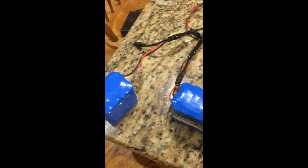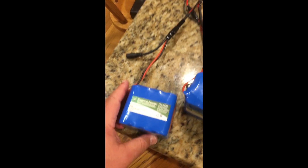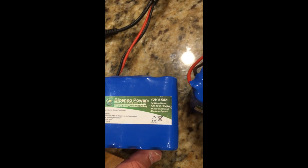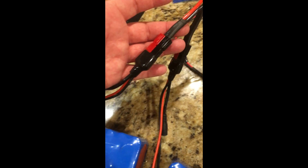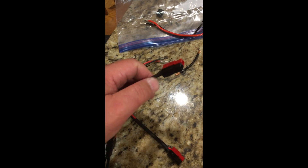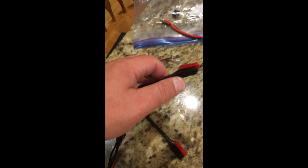These cables are in parallel, not in series. So I'm going to get 12 volts at 4.5 amp hours times two. I kind of rigged up this cable here so it's running in parallel. I can check the voltage here — it'll be about 13.4 to 13.8 volts. So that's about ready to go in.